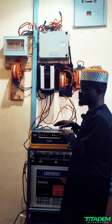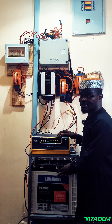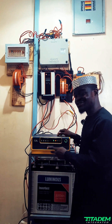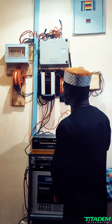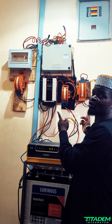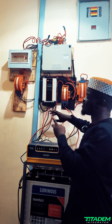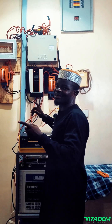There's no breaker, no surge, nothing. These are the batteries — four sets of 220 amp tubular batteries. Upstairs there are six pieces of 300-watt panels charging those four batteries. This is the stabilizer that burnt, along with this small changeover. The system is too complicated; even the client himself used to get confused about which switch to turn up or down. We are going to make everything as simple as possible.